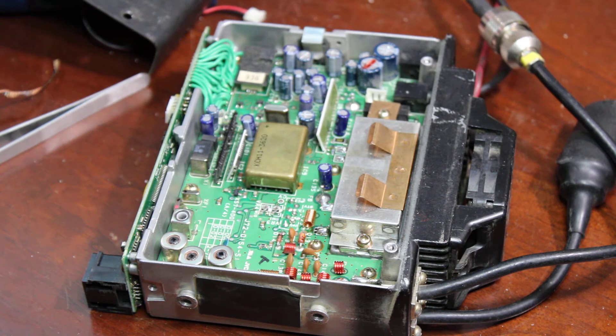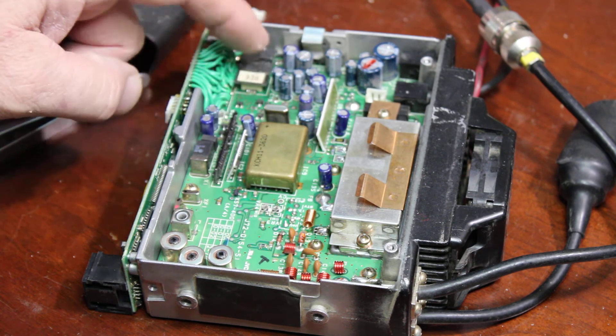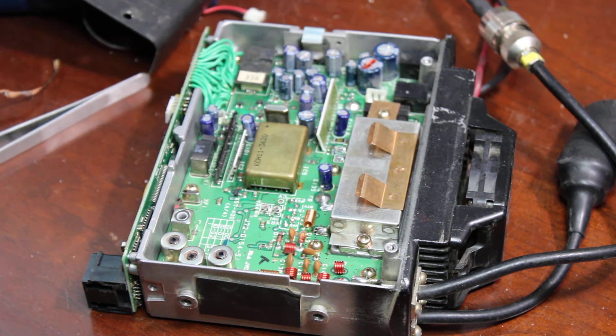You can't just touch it up and solder it because the pins on the connector itself are oxidized or something and solder doesn't stick to it very well. You've got to pull the board off, pull the connector off this board, pull the connector off the TU7 board, re-fix the pads, re-solder the pads, and put it back on. It's pretty easy — polarity is only one way; there are four pins on one side, five pins on the other, same way with the pads on the board and the TU7 board.